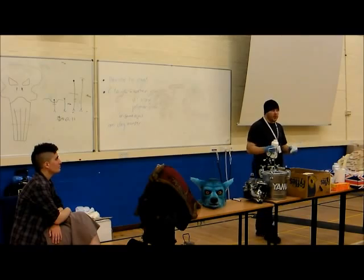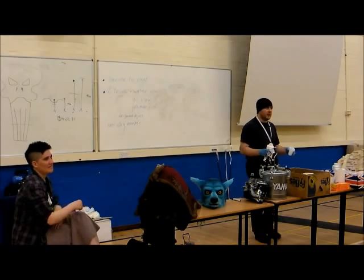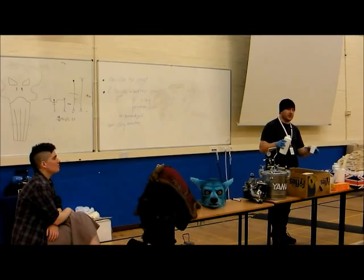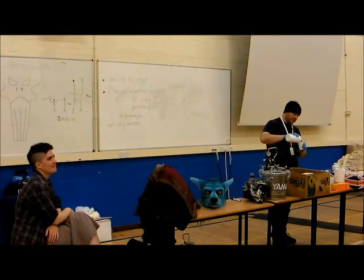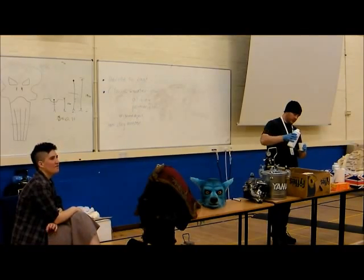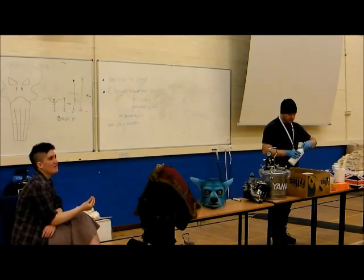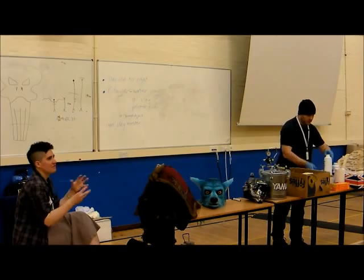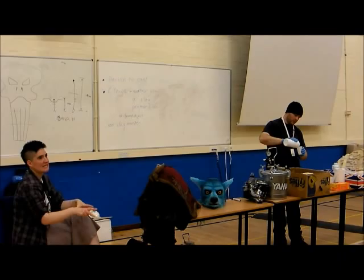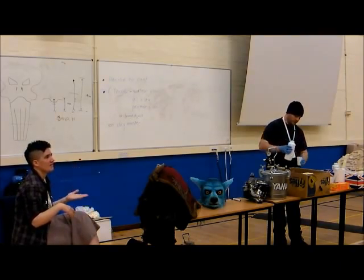If you specifically want it to cure slower, you can chill it first, in the fridge, before you mix it, obviously. Have a separate fridge. You get these cheap 20-quid coolers. Also, if you have a garage, store your resin indoors. This is for polyurethane; polyester's nasty. If you've got an open bottle of polyurethane, store it indoors, but not in your kitchen. What we do is wrap sealed bottles in a couple of bin bags in a box under the stairs. So it's not gassing everywhere, but it's also not getting chilly over the winter, because that reduces its shelf life.